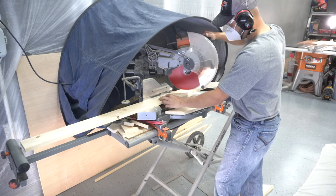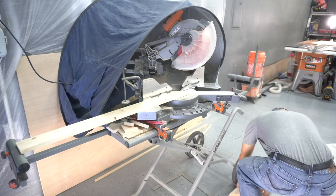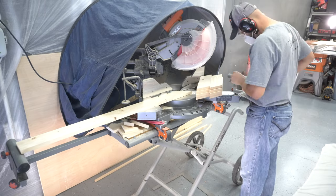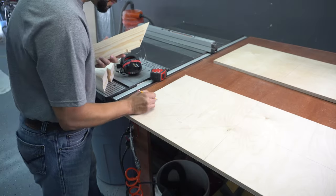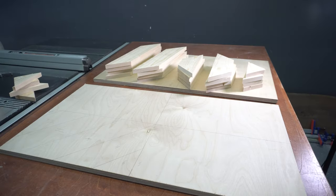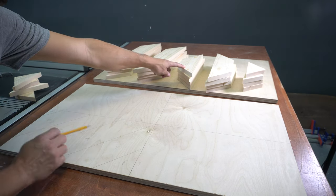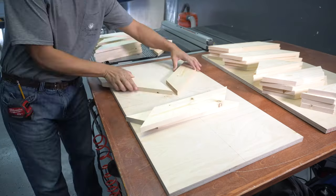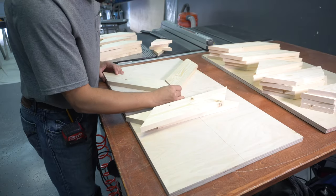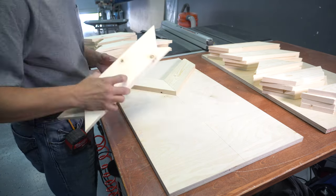I went back and forth from the miter table to the countertop, placing each piece where I wanted, marking, cutting, and finally labeling each piece of the quadrant. I ended up needing a total of six pieces to complete my quadrant. I cut the first five from different 1x4s and the sixth piece from scrap material later, as this piece overlaps two quadrants. I take the time to dry fit everything in place and ensure my measurements are accurate, and I mark each board so I know exactly where it goes.